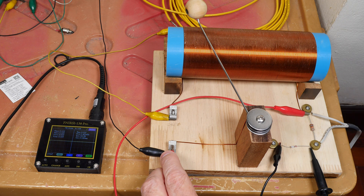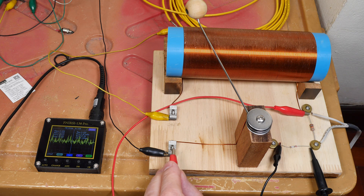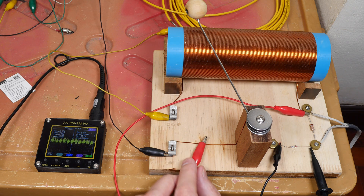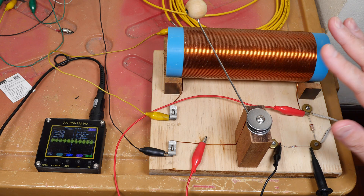Just no question. I don't know what happened or why someone would have drawn in the extra wire, but it absolutely does not work that way. Hopefully, if anybody is designing a radio from the original picture, they will see this and say no, that's not going to happen. Otherwise, it explains why I call my version the Modified Boy Scout Crystal Radio — because I leave out this wire. Well, that was it for this explanation of why I call it modified and why that wire is missing. Hope you found that useful and interesting in your crystal radio experimentation.